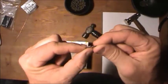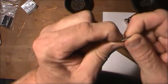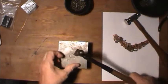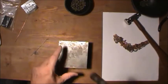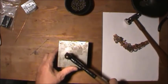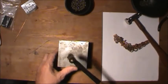Anyway, you take your two ends, as you see here, and you bend it together like that, best you can. Then lay it down, and then, like I say, you try to hold it down. You don't go ping, ping. If you do that, it'll jump out like that last one did every time. You try to hit it, hold it flat, and you can see where it actually flattens in the side to it.